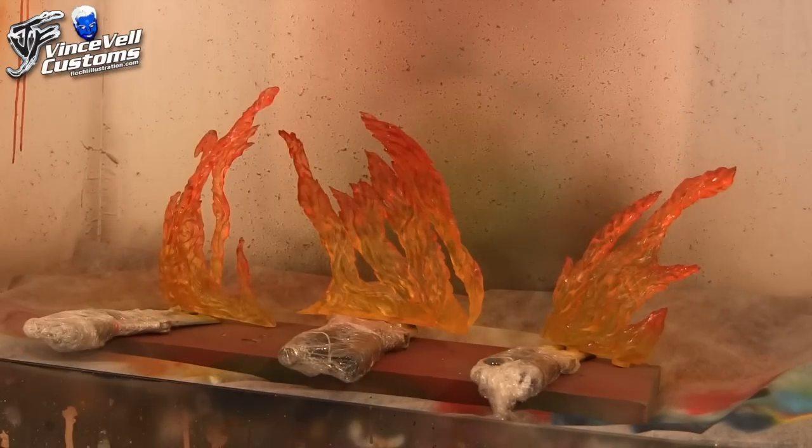And that's kind of a bad thing to do, because you can run into issues later on with masking, or if you go to grab it and you pull it off the piece. So at this point, I want to let it dry naturally overnight and just walk away from it. Just let it dry, let it do its thing. It'll really cure up by tomorrow. We're in the summer anyway, it's like 90s out, so it's going to dry up pretty well naturally, and I'd rather it do that. This way, by tomorrow morning, I could wake up and we could do our clear coat.